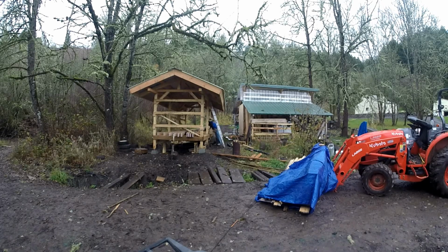Now that I've actually been working on the floor, I have a table saw set up in there, so now all I have to do is plug it in and I can basically get started on things. And I think I put up at least one or two of the upper boards here. This is where the frames from a couple of videos ago come in handy, because now I can attach a runner or a girt across that frame, and it'll help ensure that there's a solid corner there to have everything attached to.